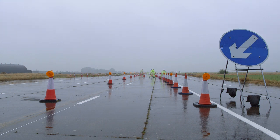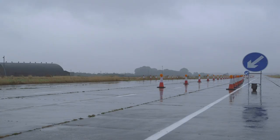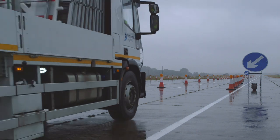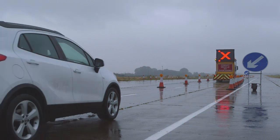All relevant signage will be altered as required. Depending upon the distance between the CCV and the last vehicle to enter the works zone, referred to as the clearance distance, the CCV driver may reduce speed further to ensure a sufficient working window is provided. If when entering the work zone the CCV cannot maintain a speed greater than 20 miles an hour due to the proximity of a road user vehicle, the CCV passes through site and the installation or removal operation is aborted.